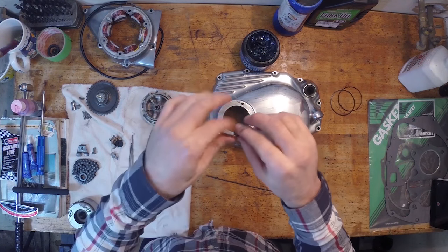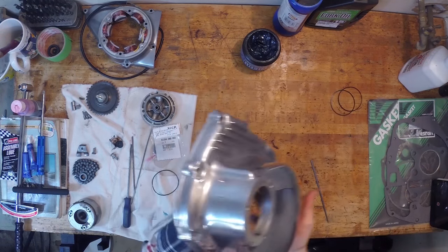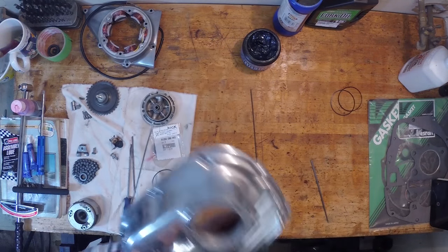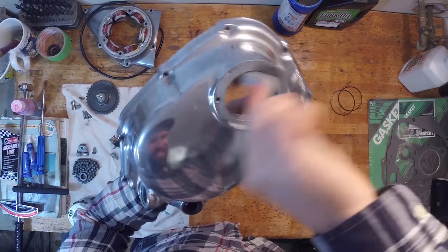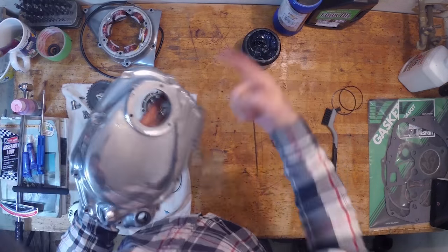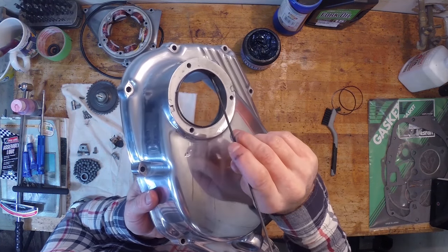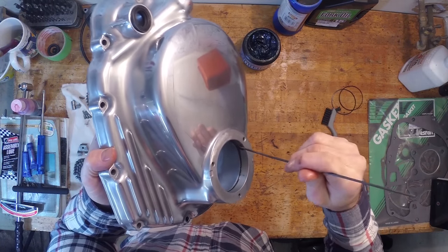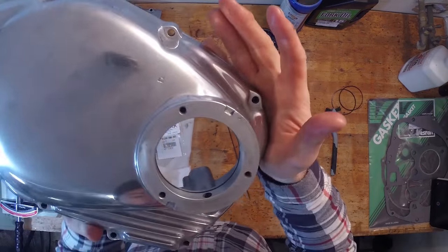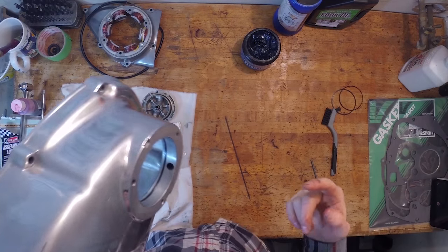I'll grease up the second one and get it into the groove in the cover. First I'll inspect the cover to make sure there's nothing sitting in that groove — any dirt. Clean out the groove a bit and add some grease to help it slide in. Just going to try and slide this into place carefully, making sure not to roll it in. Going around inspecting it to make sure there's no dirt in the track — that's really going to prevent it from sealing properly. Looks pretty good, so we'll move on.